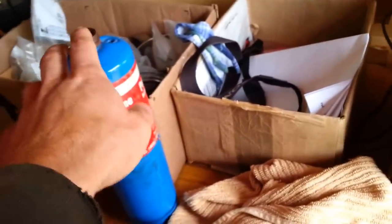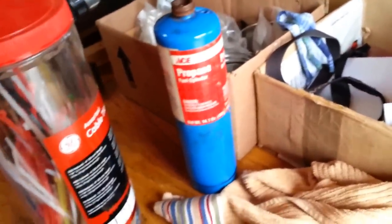There are other substances that will boil at other pressures. One of those is propane. This is a bottle of propane — it's actually empty right now. Little Coleman bottles, little Ace Hardware propane bottle. I actually just used this to transfer propane from a barbecue tank into my system. But that is my refrigerant. You might be familiar with Freon — that was a trade name for a refrigerant back in the 1930s, a very successful refrigerant. That stuff was fantastic, except it destroyed the ozone layer. R12 Freon isn't coming back. So propane — I don't burn it, it gets circulated through the system. It's recycled the whole time, it can just circulate millions of times.